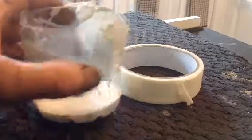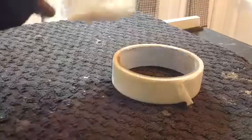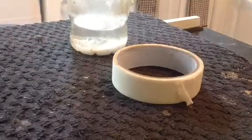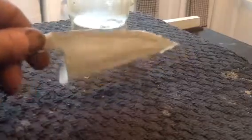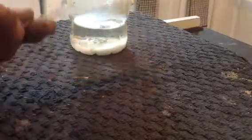Just let the salt dissolve — it's a bit warm. You only need it touch warm. Then mask off your knife in the area you don't want etching. I've done that already to save time — just put some masking tape around it. You can use insulation tape or whatever, but I haven't got any so I've got to use this.